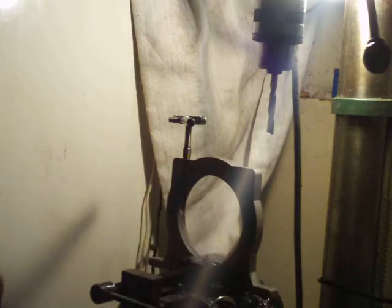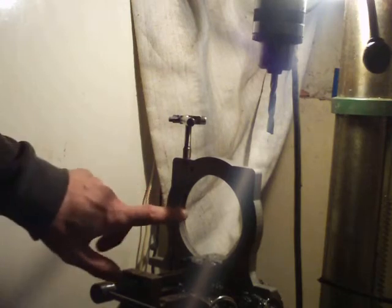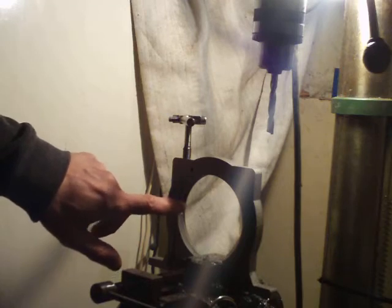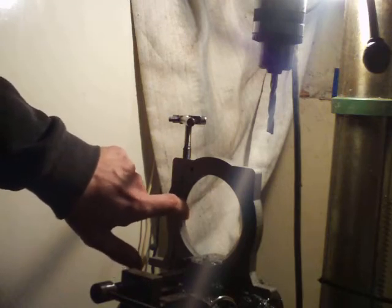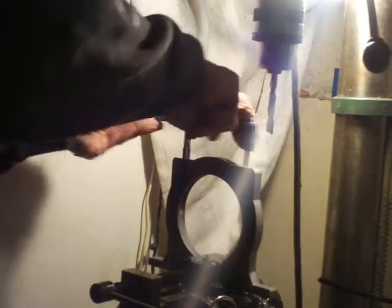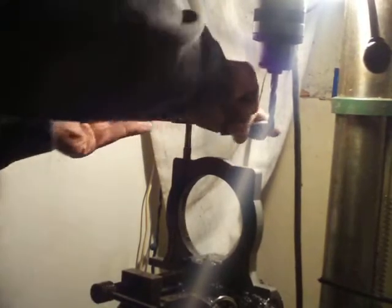We're hand tapping the stainless steel version. Beside you can see the broken bit — that was because upon breaking through the edge it was caught and snapped, so we had to redrill and clean up that edge. Now we're tapping with canola oil, which works quite well. I'm going very slowly after starting it on the press with a true straight hole.